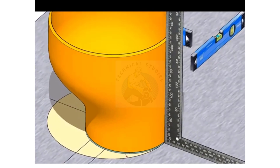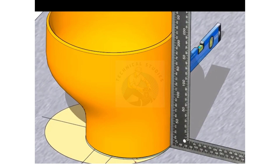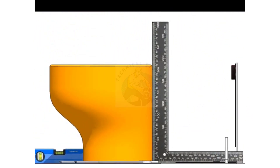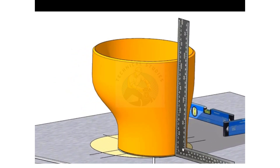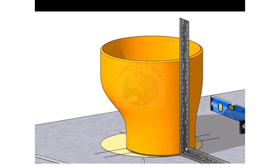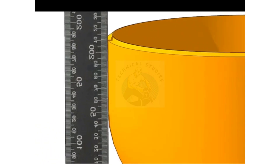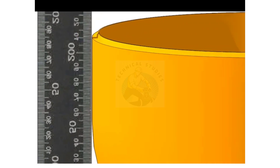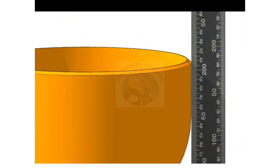Check if the flat side of the reducer is at right angle to the platform, and check if the other side is at the top. If you find any gap on any side, equally divide it on both sides by giving a shim plate at the bottom of the reducer.